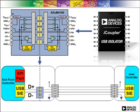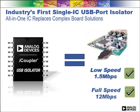When it's used as an integral part of a peripheral, the peripheral can still be certified through USB-IF, the implementers forum, as a fully compliant USB device. It can also be used to create an isolated host port or even an isolated cable. Our features include support for low and full speed operation — that's 1.5 megabits and 12 megabits per second. It automatically handles high speed devices properly, even though it doesn't support the high speed data rate of 480 megabits per second.